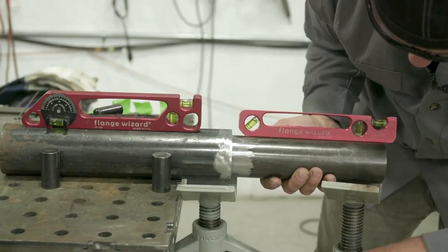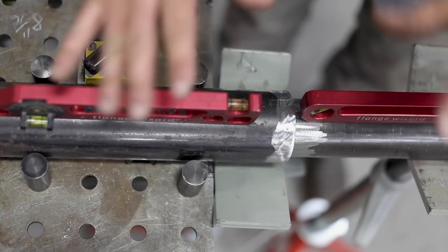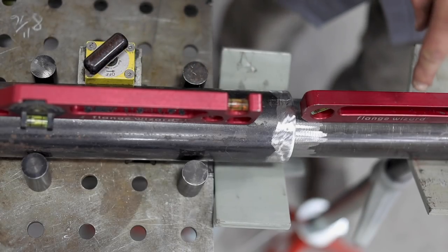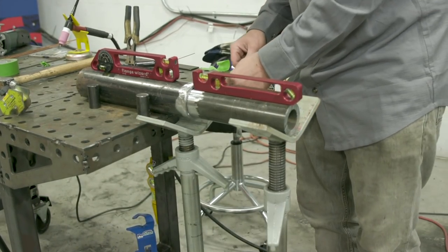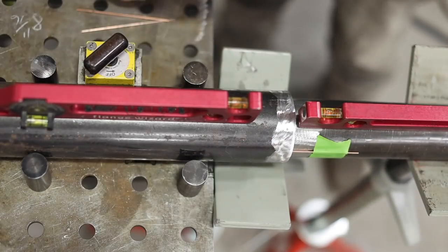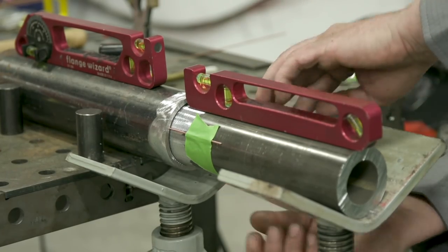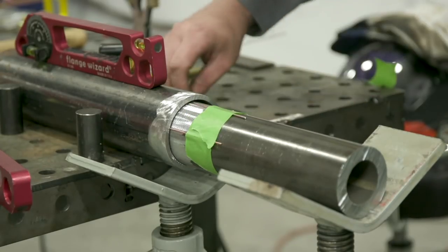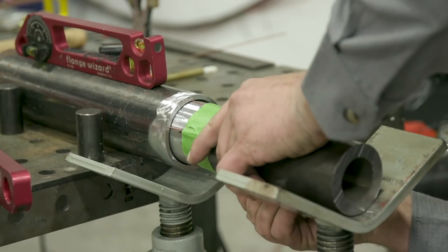We're going to kind of get this leveled up. Make sure there's no gap. Since the table is not level, we've got to make sure this bubble matches this bubble on this pipe. The next thing is we're going to get our spacers. Since we need one-sixteenth spacers, I just took ER 70S dash 6 wire — one-sixteenth — whatever's at your disposal. Sometimes these fall around, so I just stick this in here a little bit and take a little tape so it's not fighting with you.